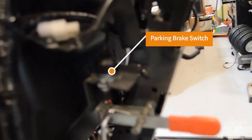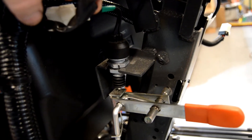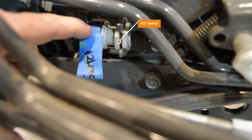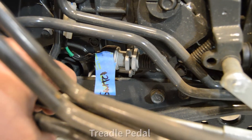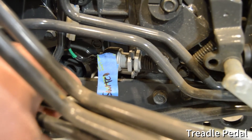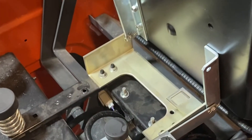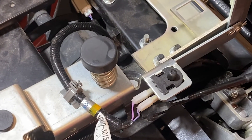Up underneath the dash you'll see a parking brake switch as part of the operator presence control, and then of course the starter and the alternator under the hood. Down on the transmission, tucked up under here is a small switch — this is the HST switch. It's part of the operator presence control, so if you bump the accelerator pedal it checks to see if you're in the seat, and if you're not it turns the engine off. Here's the operator seat switch right here, underneath the seat.